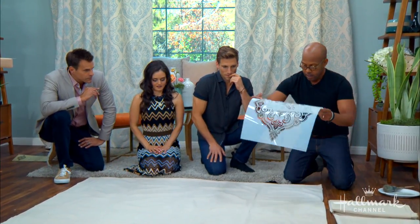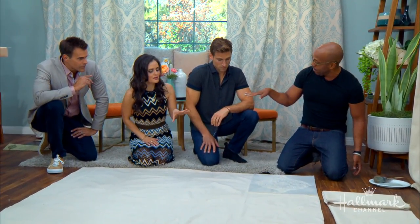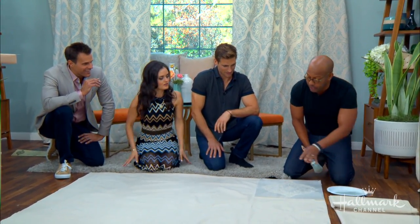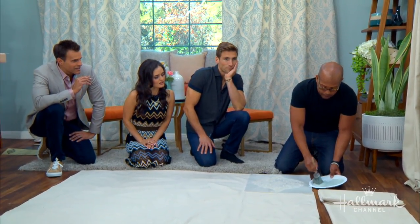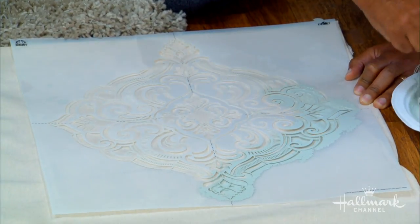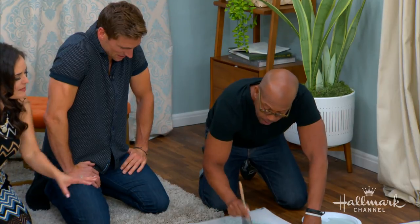For your lineup, you're going to start with your stencil all the way to the edge, get a piece of chalk or a slight pencil, and just mark that corner — that's going to be how you start with your lineup. The stencils are made to sort of interlock. The secret is not to have a lot of paint — sort of empty out your brush. You've lined it up, and then you're just going to what's called pounce: straight up and down, all over it. What you want to do is this up-and-down motion — what you don't want to do is brush.